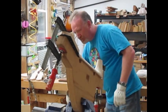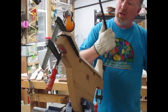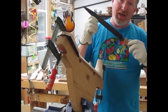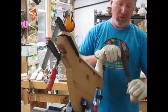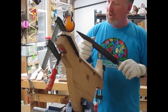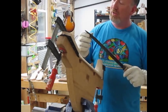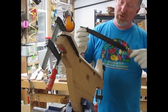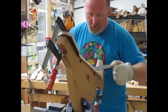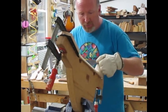As I move in closer to the final shape, I'm going to go with this number eight stitching on a cabinet rasp. It's a little less radius than the half round and probably pretty similar — maybe a little bit less than the Modeler's rasp, but wider. It's still plenty of radius to get in here and now it's going to allow me to refine that shape.